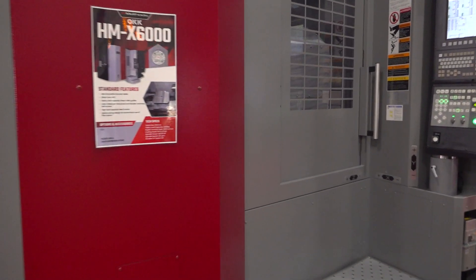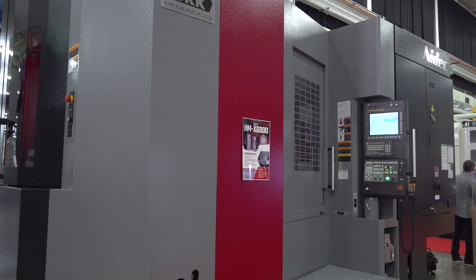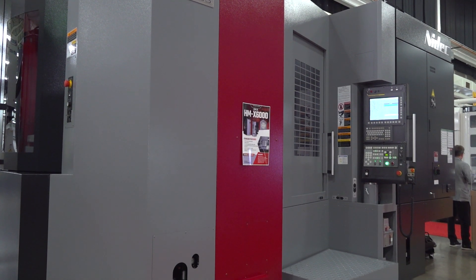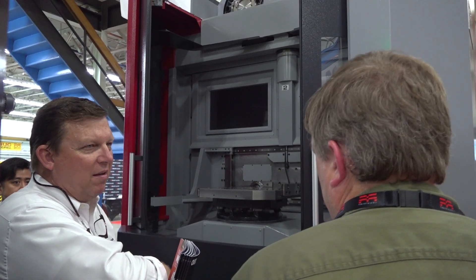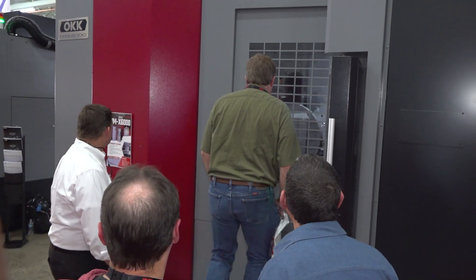This is a horizontal five-axis machine by OKK — a 24-inch pallet machine, CAT 50 taper, 12,000 RPM. The beauty of this machine is that it's a horizontal you'd normally see, but with a five-axis version featuring a trunnion support. The machine can do all the rugged cutting of a horizontal with better chip management, but now has the benefits of five-axis for reaching all those other locations. And by the way, it's a pallet-changer machine. So now you have a horizontal pallet machine with five-axis — truly the dream machine, combining all the benefits of a horizontal pallet changer with five-axis capability, which you don't see very often.